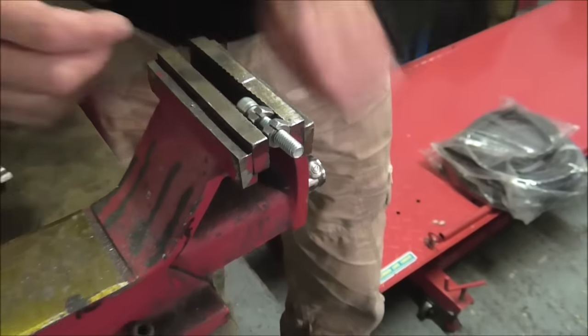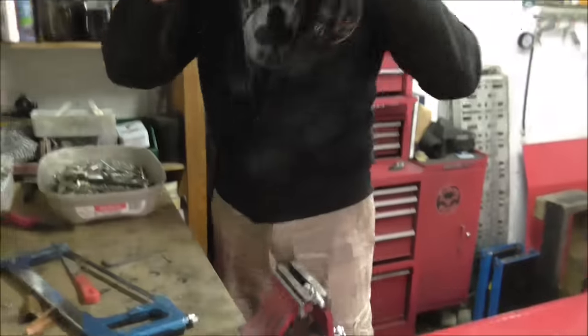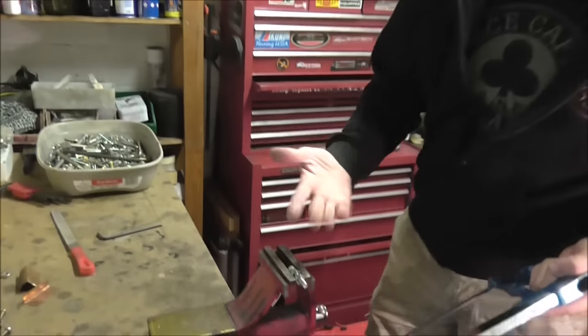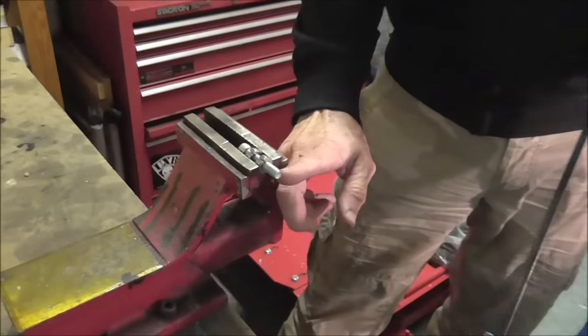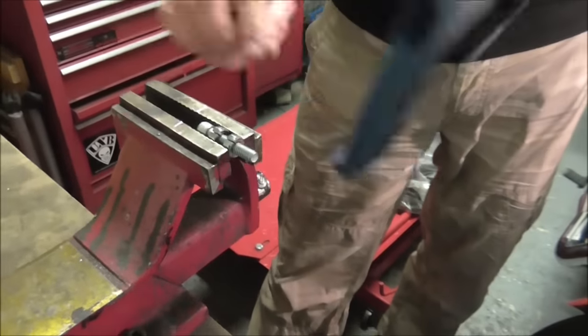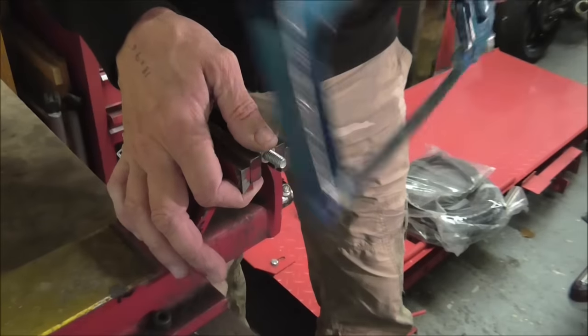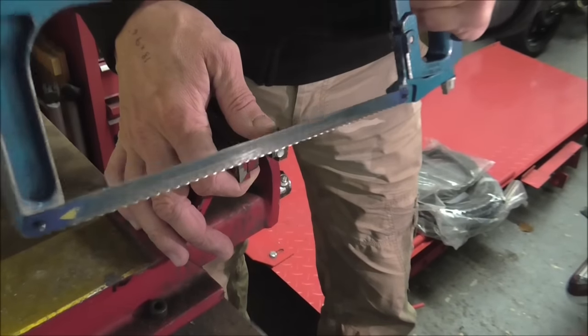If you normally put regular nuts in and wind it up, you'll oval the nuts that are on there, and that will distort the thread inside — because you're squeezing the thread on each side, you just distort things out of shape. Now, this is the actual reason for doing it: you want to cut the end off. Let's say we want about 6mm off the end because there's too much of it in the job. Back to basic skills — pop the thumb in the way, up against your thumb.